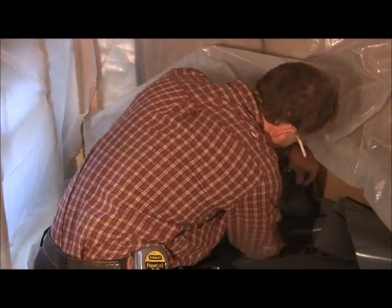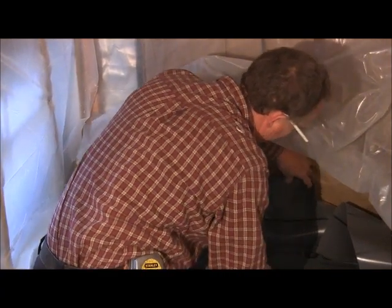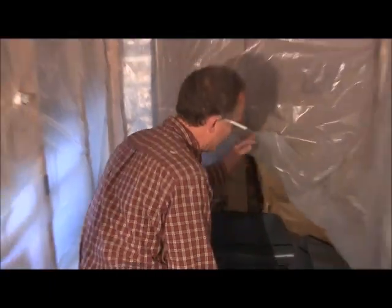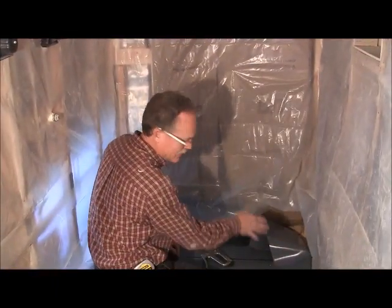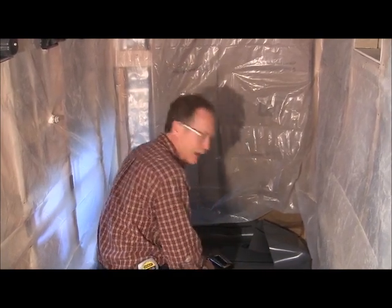Get in the corner. So you get the idea. Just work yourself around. Pull it up tight to it. Put a staple in it, or you can put a roofing nail, either or. And then once we get this all set in here, then we'll bring our board down and I'll show you how to do that. So I'll be back with you in a minute.